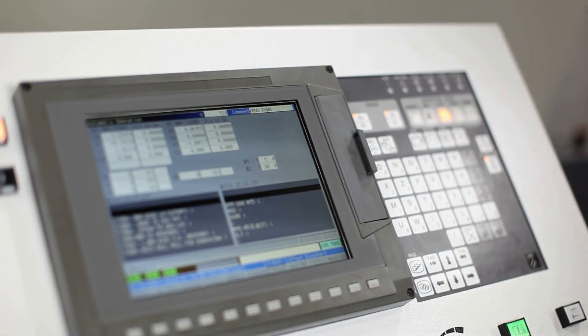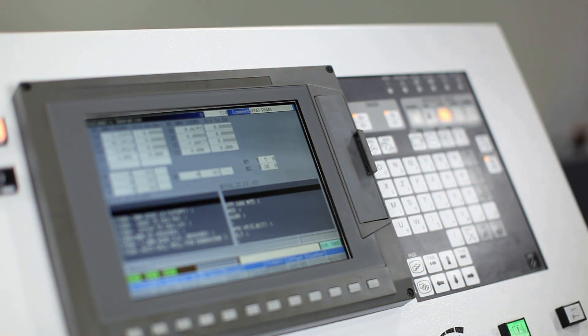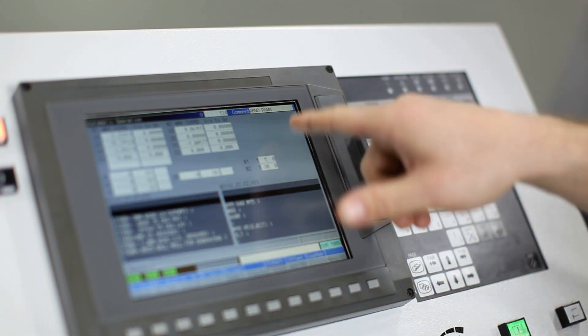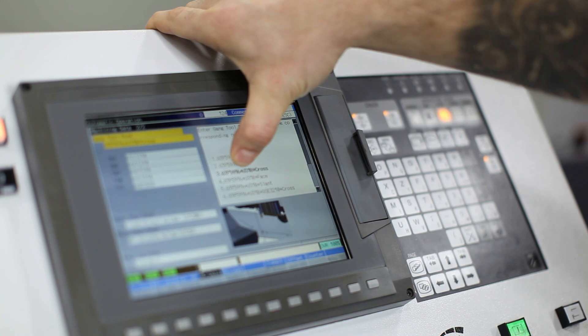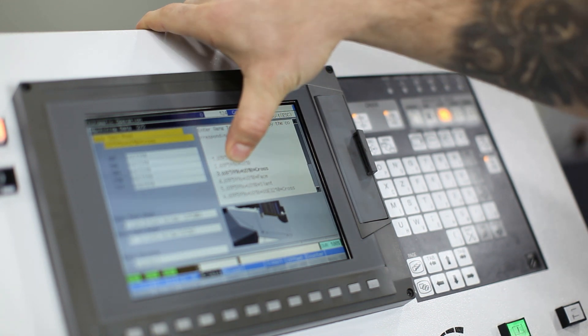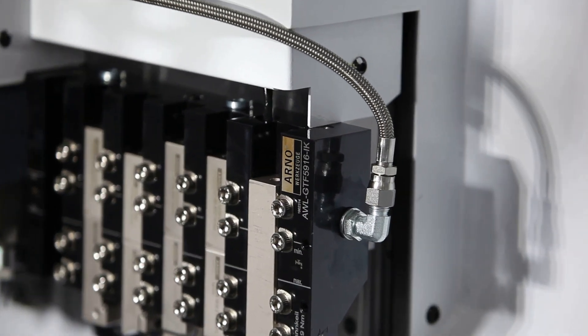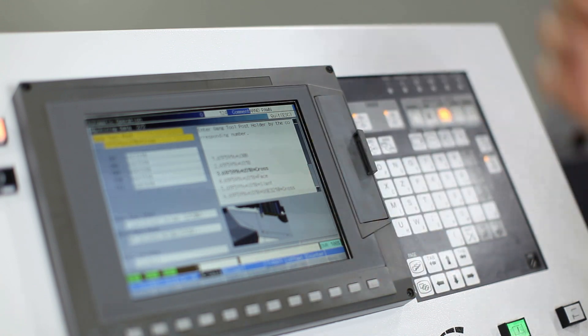Now that the Arno gangplate is installed, another great feature about this gangplate and the ease of its adaptability is that when you come into your machining data and go to configure your new tool, the Arno gangplate is identically cross-referenced to the Citizen gangplate. The 5916 will be the same number that you'll see on your Arno gangplate — you have to change nothing. Just select the right configuration for your cross-tools.